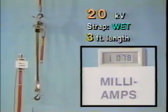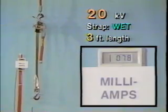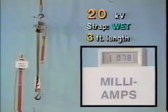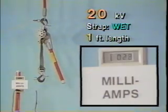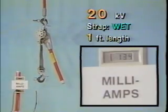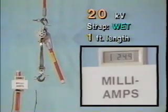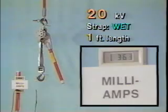After the arcing activity begins, the continued electrical stresses bring the strap to its kindling point, and catastrophic failure eventually results with predictable certainty. At the one-foot length, the wet strap competes with the short air gap as alternate paths to ground. The dramatic conclusion to this test should burn into memory for all hotline maintenance this one guideline: for sufficient insulation from conductors energized at distribution levels, do not depend on a nylon strap hoist alone.